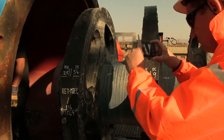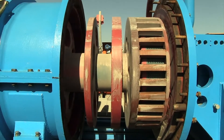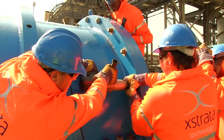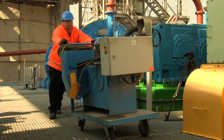Take a full photographic record of all wear components. Close the Isomill shell using the hydraulic power pack. Uncouple the hydraulic cylinders from the shell and retract the cylinders fully. Store the power pack as per the procedure.